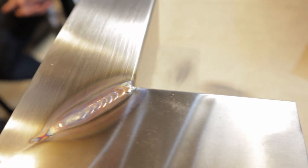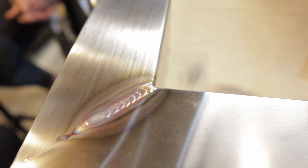To avoid pinholes, the next step is called tailing off. When you have finished your weld, lean the torch over and increase your travel speed. This decreases the penetration of the puddle by directing the arc towards the surface of the work, and with a flick of the wrist, pull away quickly. As you can see from the example there is no pinhole. This way of extinguishing the arc is used on both LiftTIG and scratch start.